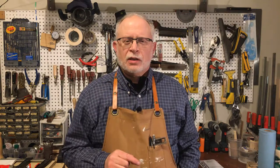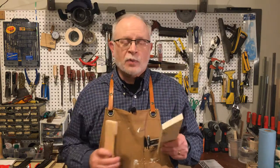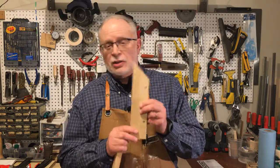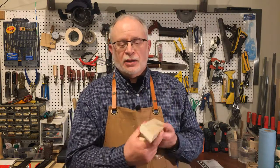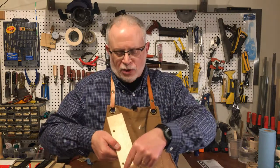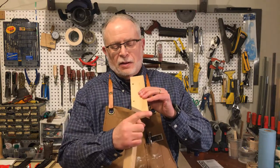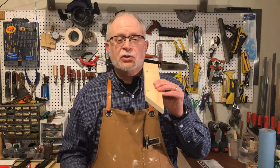What's the difference between a miter cut and a bevel cut? That's an excellent question, and I just happen to have some materials in my apron pocket to help answer that. If you remember from part two, we did a miter cut on a miter sled. A miter is any cut across the face of a board — any angle other than 90 degrees is your miter cut.